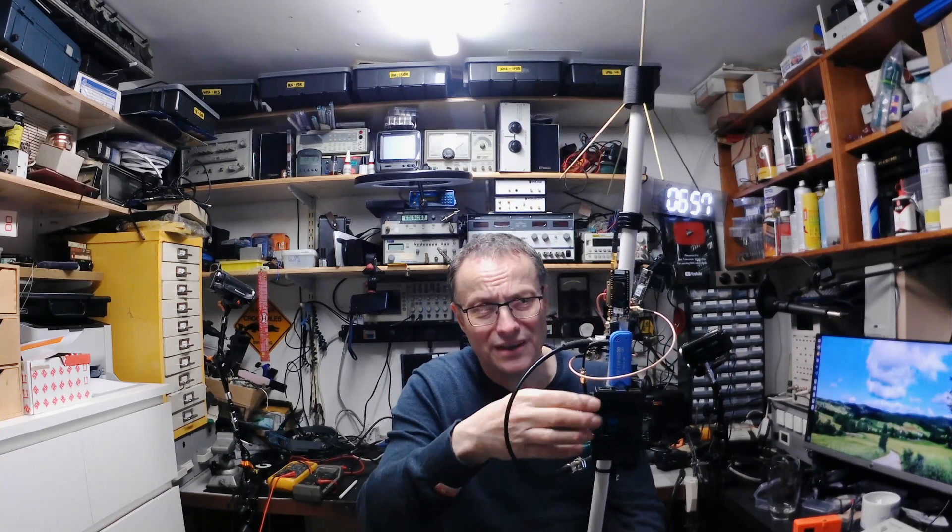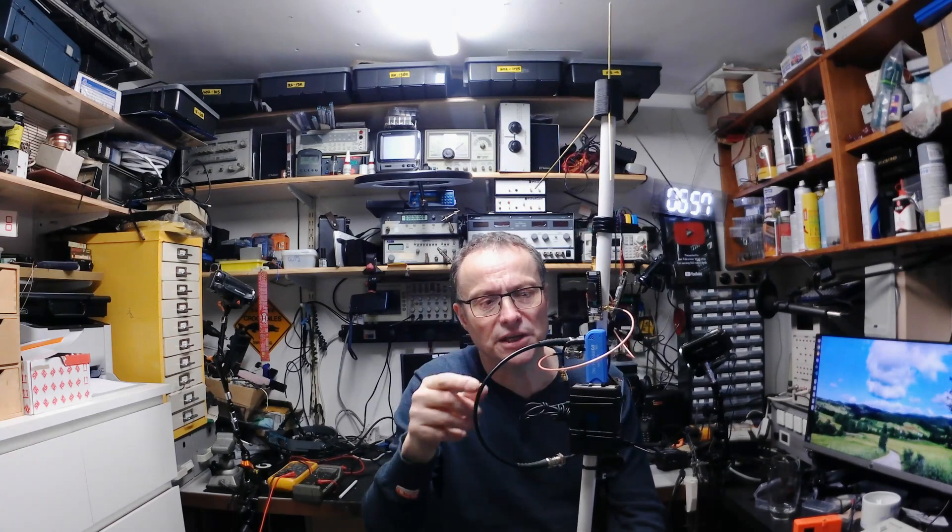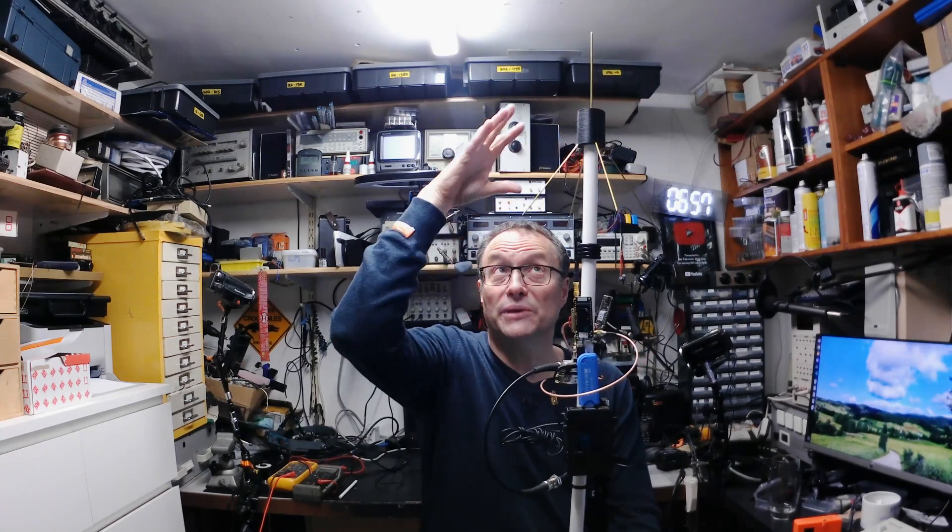So we get packets of information from that one too. Why have we got two? This one is VHF. I don't know what the response from a UHF antenna is going to be like at 144 MHz — it's pretty grim, I'd imagine. But we might get something and it'll make an interesting experiment.